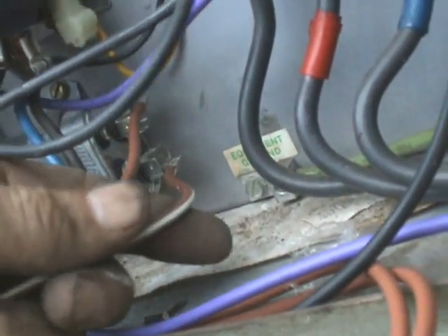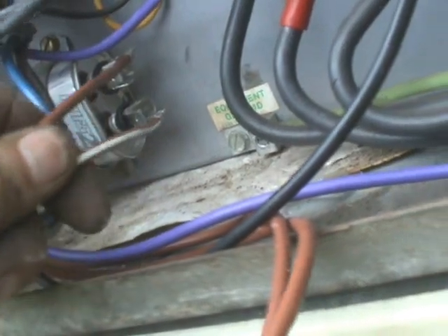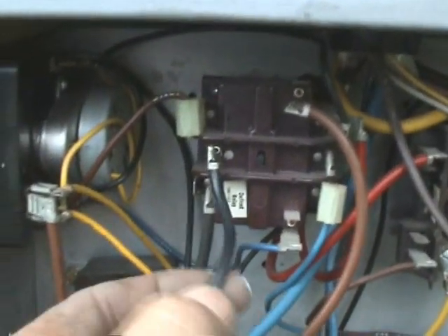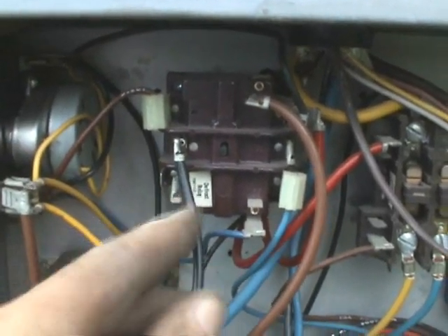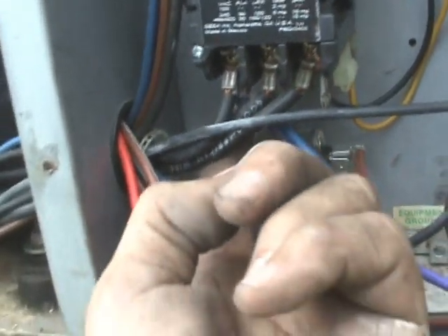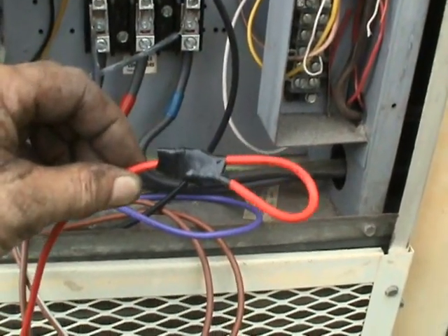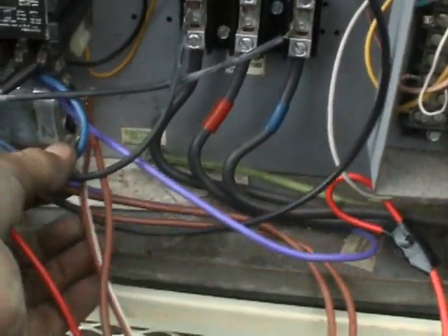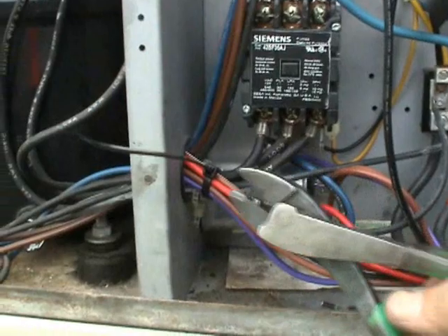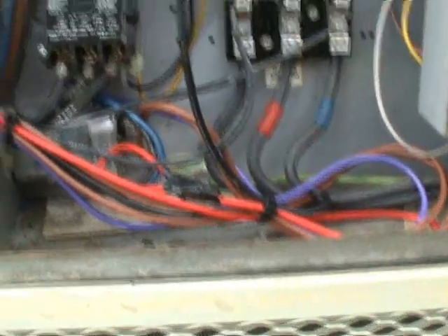Now I have the run capacitor wires in place right on the run capacitor. I opted to use the four-wire setup, so the only wires on this run capacitor are the brown and the brown-white. The black one, which is the high speed, I put up here on the defrost relay. The common wire - the purple wire - goes down here on line one on the contactor, and I terminated the low-speed wire which is not going to be used in this case. All I have to do is take some wire ties and make things all neat and tidy.